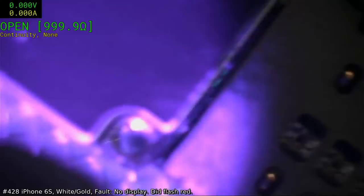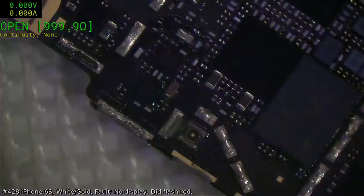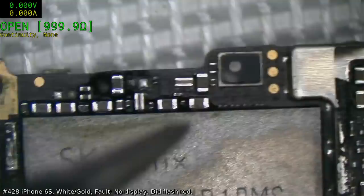Oh no. It may not even be flux, it'll just be something else. But yeah. Alright, guess definitely going in the ultrasonic. But like I said, I'm not too sure about how these MEMS sensors go in the ultrasonics. Can't be great for them, but at the same time, we can't leave the board in this condition either.